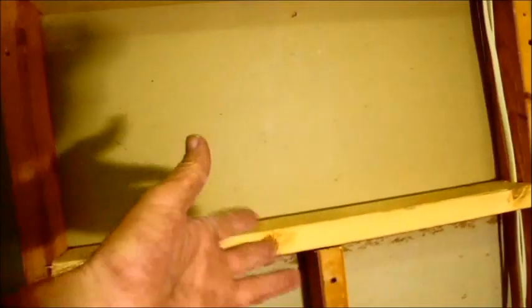What I'm more concerned about, rather than being an eighth of an inch off of level, because I can make up that when I start tiling, is that the distance is even. So if I'm 20 and 3/4 here, I want to be 20 and 3/4 there, too. That's as easy as it gets. I didn't show the process because it's pretty easy. Like I said, you need a couple of tools to cut out all of that and cut your wood and put it in there and nail or screw in.